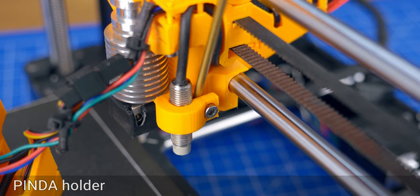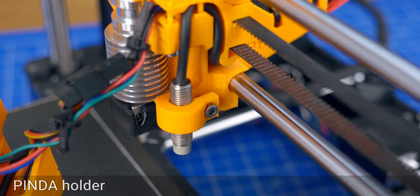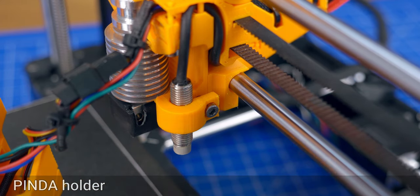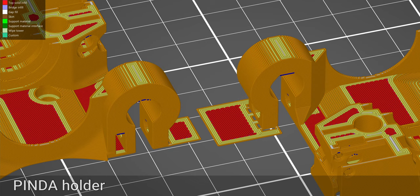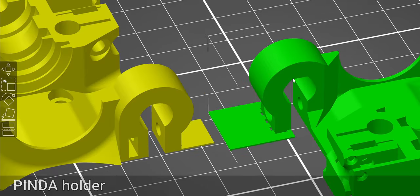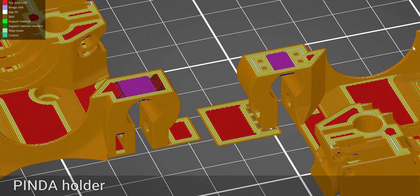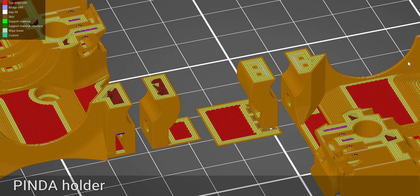but this gap is not supposed to close. Tighten the screw just enough for the probe to stay firmly in place. This should solve it, but I went ahead and added reinforcements to this round part, so that it gets printed filled in and not hollow, hopefully reducing the risk of it breaking. I've also changed the shape of it to help printing the overhangs. On the other hand, it being completely filled also makes it a bit less flexible, so try not to over tighten the screw.